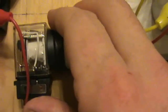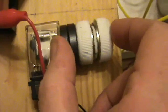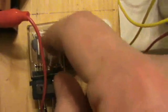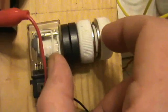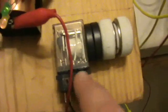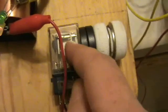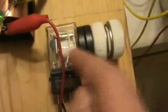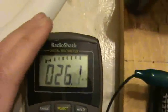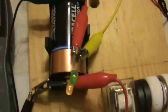This relay is a 12 volt relay, but with the magnet moved to a certain spot, this thing starts oscillating even though it's a 1.5 volt supply — which I find pretty incredible. Basically, the magnets cause a flux in here that allows the relay to get going even with this lower power. The current draw on this battery is around 26 milliamps and we're driving two LEDs.